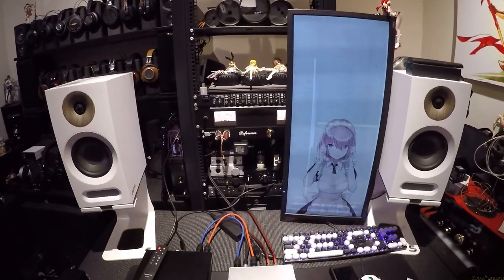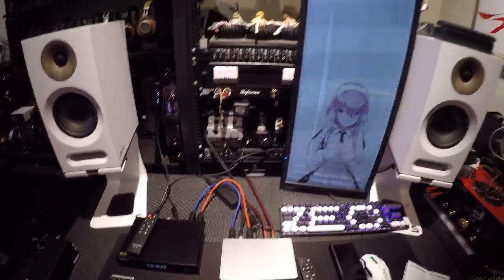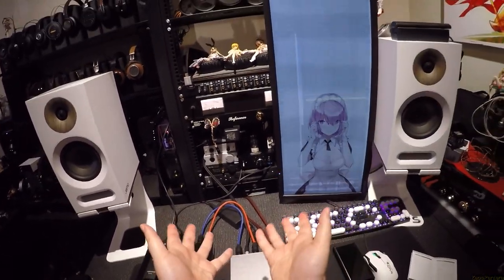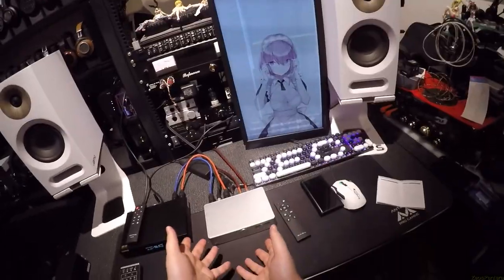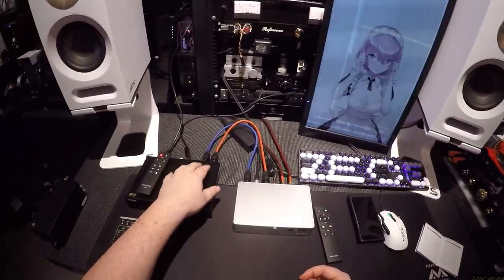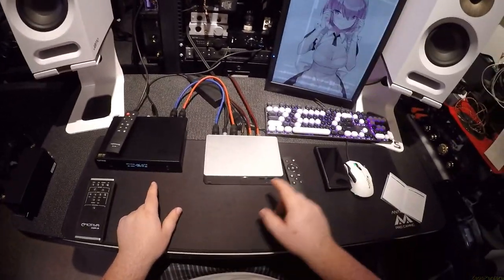Because you don't want to over-voltage an amp. An amp could be the cleanest thing on earth and it expects two and a quarter volts, or in this case six volts, and it's just sitting there waiting for it. And all of a sudden it gets like nine and a half — and it's like, why do you sound so shitty? Because it's killing me. And it doesn't matter if you lower the volume — if the voltage is too much coming out of a DAC, you can distort your amplifiers. So I'm going to lower that six dB.